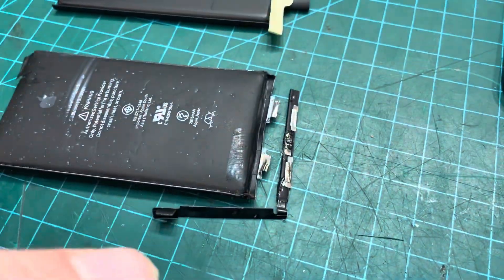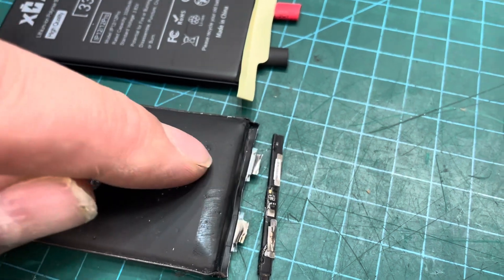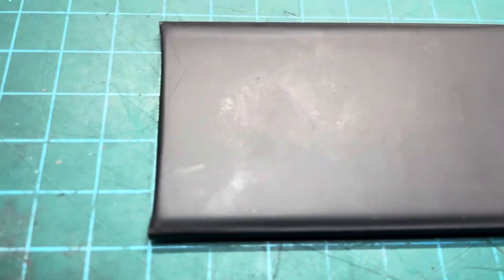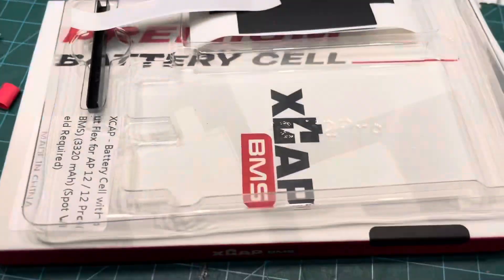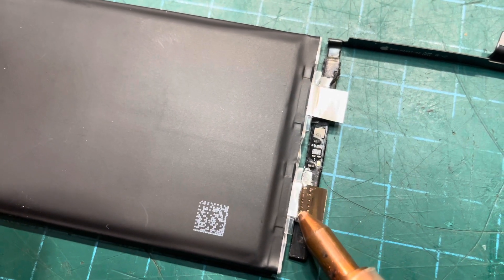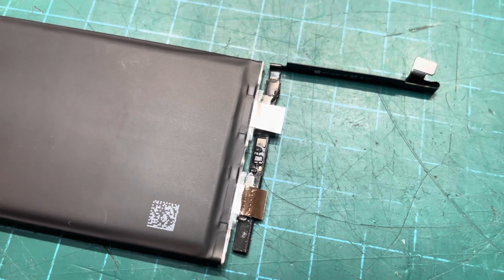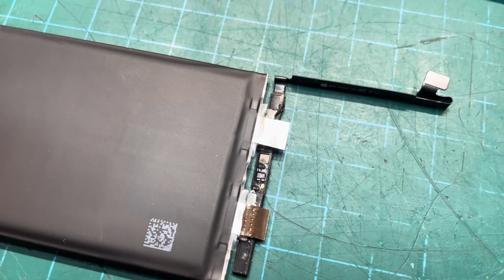Remember the orientation of the BMS with the battery, and then when we transfer it across, make sure that the aluminum anode/cathode is the same on where you put in the replacement, and then we'll get that spot welded together. It's pretty much lined up to where I need it to be. This company decided to already spot weld some nickel on there for me, but it's exactly where I need to spot weld to get it onto the board. So I'm going to spot weld those on with my TinyCow weld spot welder - I'm going to do four joules, then five joules, then probably end up about eight joules, just to put a few little tacks on there. It should hold it perfectly.